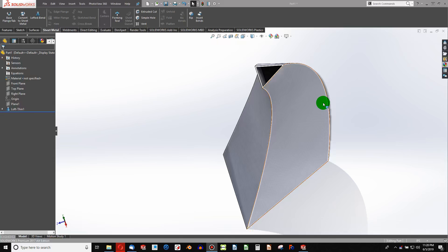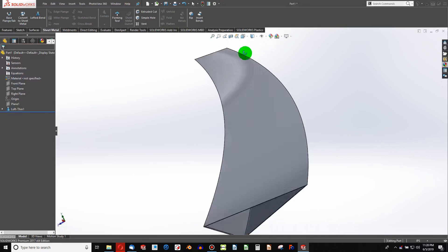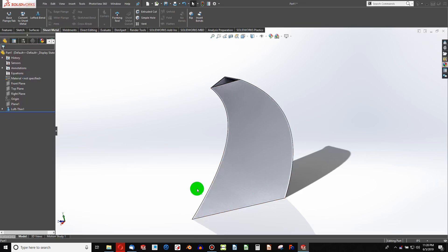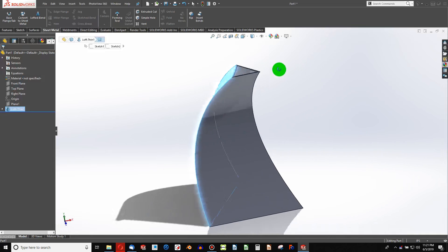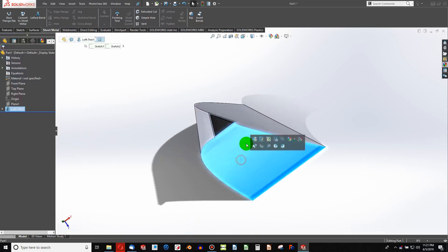This video was a viewer request on how to work with a shape that looks something like this and be able to make it in sheet metal. I received this request via email and I'll attempt to do my best to address this. The first issue with working with this is that there are non-planar faces. Three particularly good examples here. Working with non-planar faces is very difficult in terms of sheet metal because sheet metal needs to calculate using either planar faces or very predictable bends, and this doesn't really fit in any of those categories.